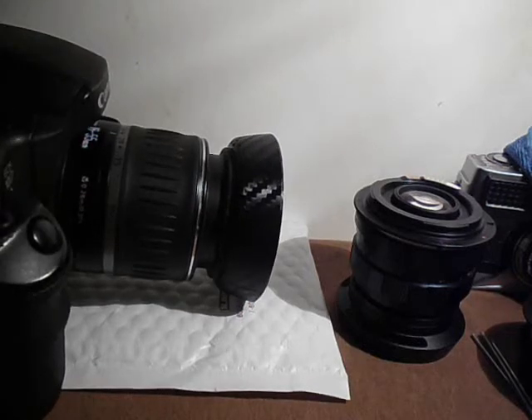The first time I came up into it was when I modified my 18-55 kit lens — I modified it from EFS mount to EF mount so it would mount to my Canon 10D. The 10D has a mirror bigger than APS-C size mirrors but smaller than full-size mirrors. It was made just to take EF lenses, but a lot of people modified the 18-55 so it will fit. I read hundreds of how-to's and all of them said that it cleared at 18mm just fine, so I took their word and didn't check.